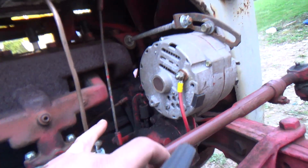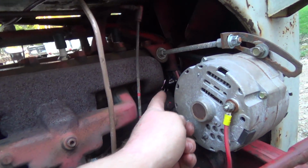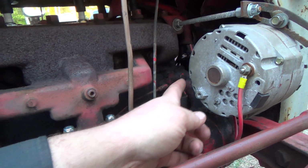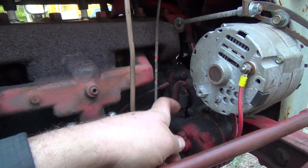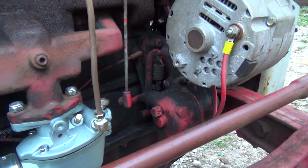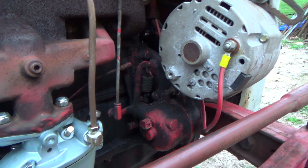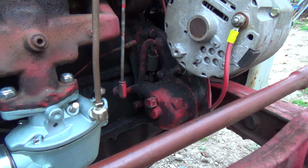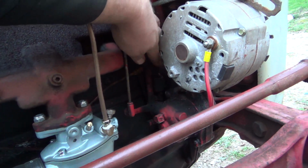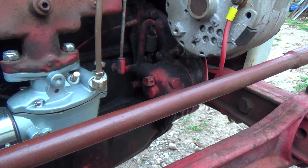It should definitely have an oil line. I think it's supposed to come in from the filter area, sort of behind the coil and the wires, and then it comes over, not too close to there, but down and then into here. I think that should have oil going into it. So I'll have to have a look at that when I get that canister from the filter cleanup, because I think someone's bunged that off. Why, I don't know, but probably because these things here are so worn out that they were leaking. So they just said, yep, get rid of it.